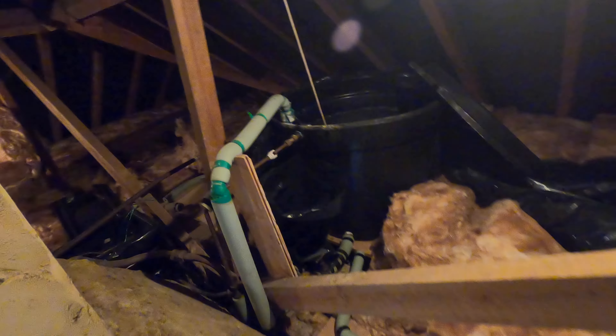I'll show you what I did in the loft for anyone doing home renovations themselves. I'm definitely an amateur plumber — I know electrics but I've been learning plumbing as I go. I drained the water tank using a valve downstairs, turned the water off at the stopcock, drained the tank, and put a push-fit connector on. A carpenter told me years ago to always put a plastic bag under these fittings in case they drip. The central heating tank that was leaking on day one was capped off by my plumber, so now with nothing going up to the tanks and nothing coming down I knew I could safely remove everything.